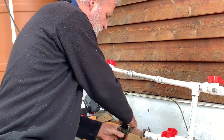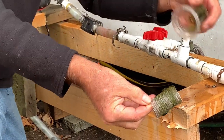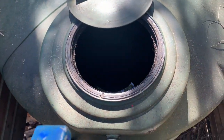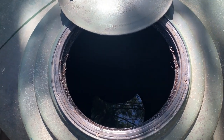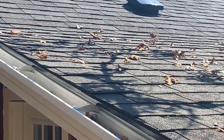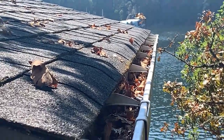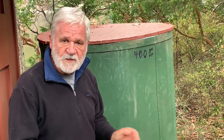I'll show you here. Turn these valves off. This is sort of our pre-filter from the pump, and you can see — this is just in the last week. If you store your water in a tank, this is probably going to happen no matter how careful you are, and warm summers are going to make it happen even faster. There are three reasons for this. First, if you're collecting water from the roof, you're also collecting anything else that is on the roof, like bird poop and leaves and dirt. Second, whatever's in your rain gutters is going to add to the mix. Third, standing water — whether it's in a rain barrel or a cistern like this, and no matter how well you cover it — is an oasis for mosquitoes and bugs looking for a place to lay their eggs, and they're going to find their way in. Mix all this stuff together, and something's bound to happen.